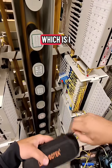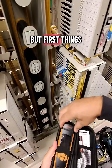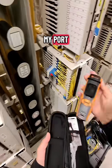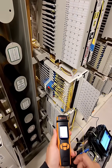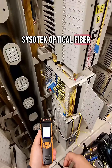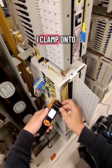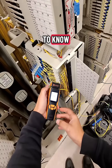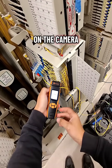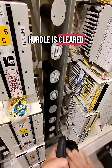So today I got a simple task which is I need to do one splice which is down in the basement, but first things first I see a patch in my port, so I'm going to be a good little boy and I'm going to check this guy out. I use my Sisotec optical fiber identifier, or my live fiber as I like to call it — I clamp onto it and it's going to tell me everything I need to know. It's telling me that it's dead, so first hurdle is cleared, let's move on.